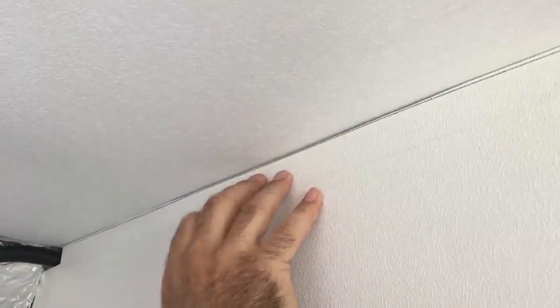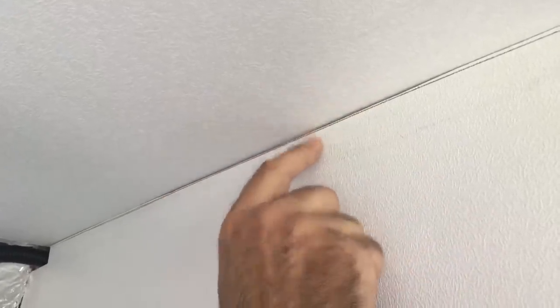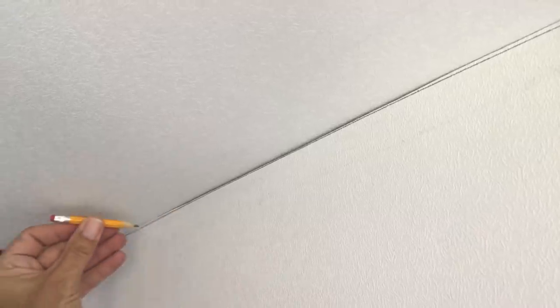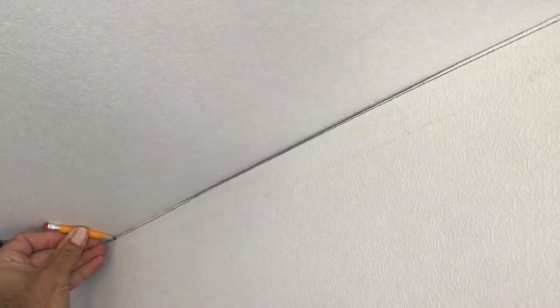Now we've touched on scribing before, you can see there's a very tiny little gap up here, and I want to bring this in really nice and tight. So rather than using the scribe tool, all I've done here is I've just got my pencil and I've laid it flat on the ceiling, and then I've just run it along the ceiling,